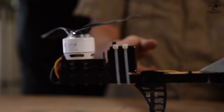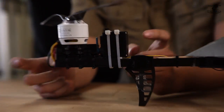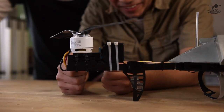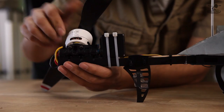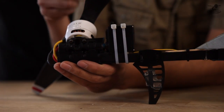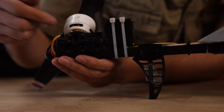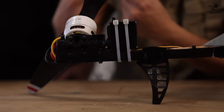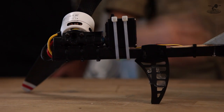Yeah, this is not something you guys are going to be able to do, at least very easily, but I hacksawed the top of the tilt off and jammed that servo in there. If you look here, this bolt pattern is not conventional. It's not your 19 by 16 millimeter bolt pattern. It's something different. I don't know what it is. So I had to drill this out with a Dremel tool and just run the screws in there and get four of them to bite. And it has not let go yet.